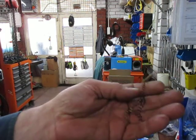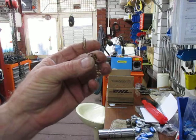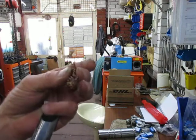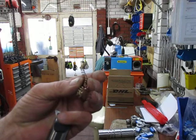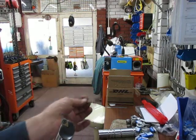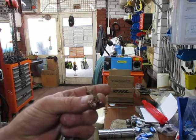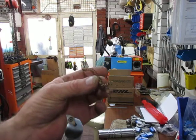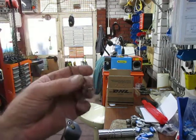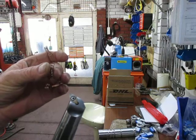— the chips produced are these curly ones and they're a nice tawny color, which is ideal because that's showing we're almost to the blue — a perfect chipping. Because of this color, we know that we can bore away and produce these chips without introducing much heat into the job and into the parent metal. This is also a good sign for me of how much wear I'm getting on the tip — as soon as these start to go towards the bluish and the noise level goes up, I know it's time to swap the tip over to a new, sharper end. So that's my telltale.